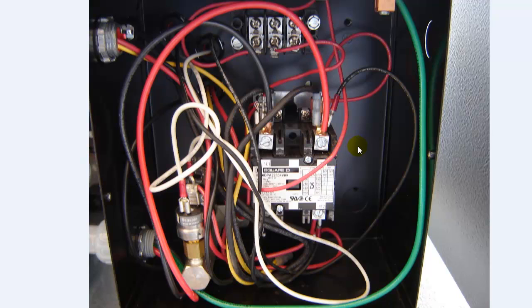Here's the inside of the control panel. As far as the electrician is concerned, there are only a couple of connections you need to worry about. This control box came with a ground lug, so we were able to tie right onto the ground lug. And you just have your line coming in — that's all you need to worry about. All this other stuff is pre-wired from the factory. We didn't have to do anything else in there, just land the line side of the disconnect.